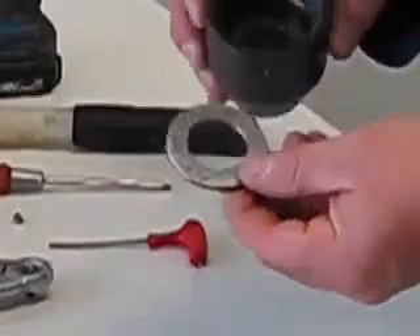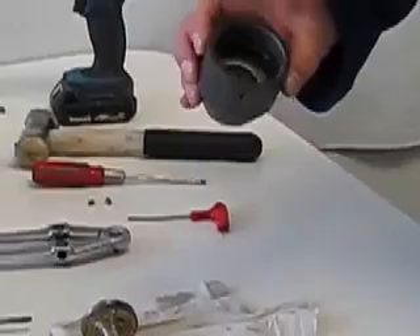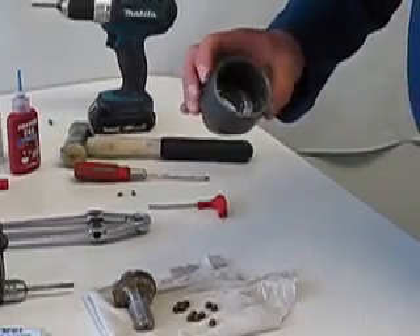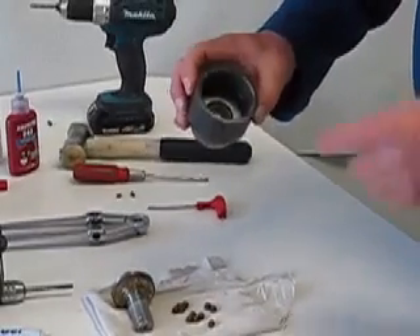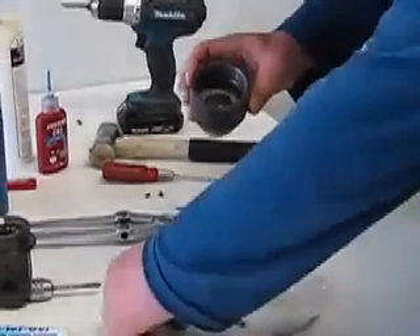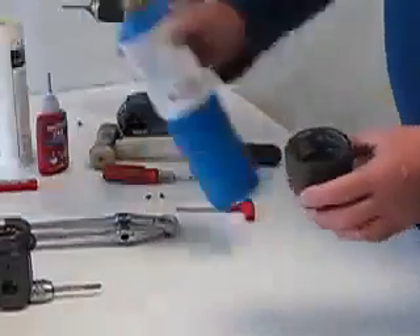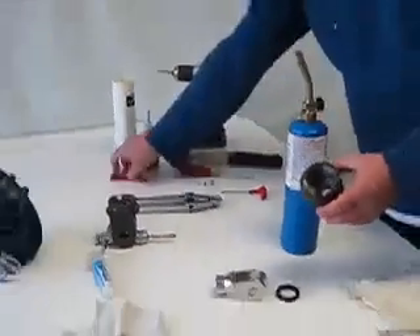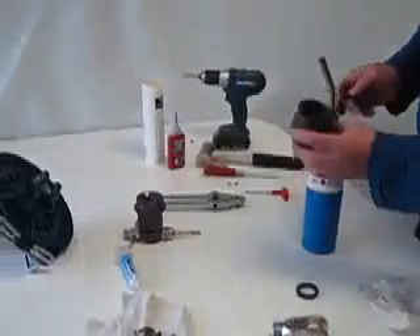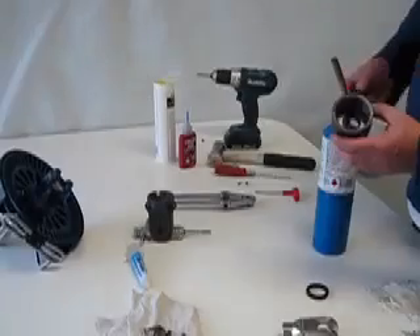It could be excessive. If you were only looking at a service, you'd have to say that was fine and you could reassemble the unit as it is. But in this case we want to remove it completely to show just how it would be used. So we'll need a butane torch because the aluminium body is going to have to be warmed — it's a shrink fit.